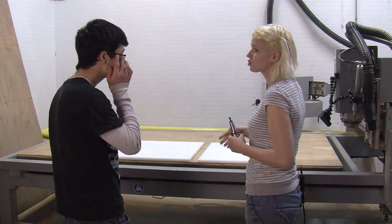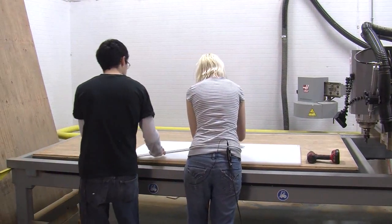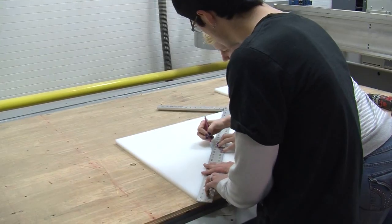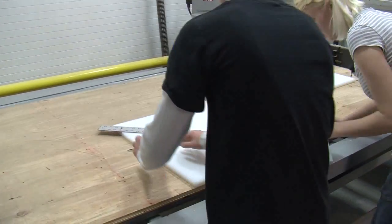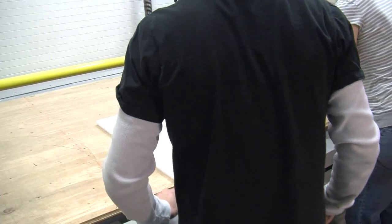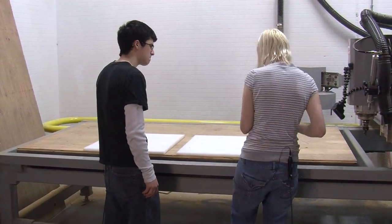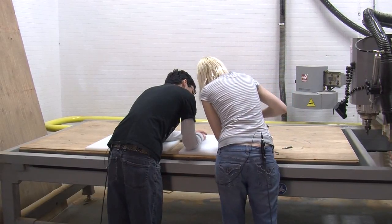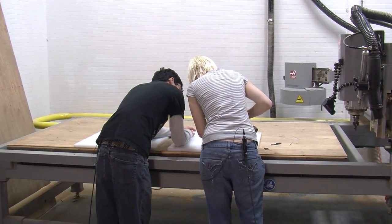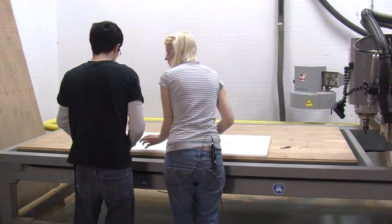So we want the T-square and a marker so we can find the middle. Make sure that your corner lines up. The nice thing about UHMW is it's pretty much putty — you can do whatever you want to it. The downside is it eats tools. It'll cut really nice, but after about an hour your tool doesn't cut very well anymore and you're just gumming it up.